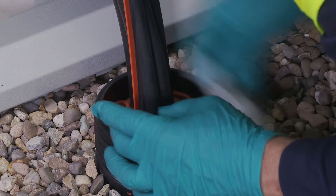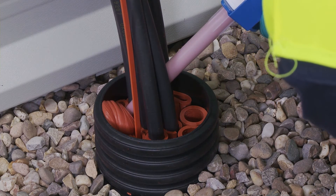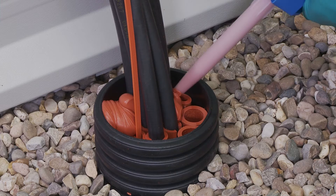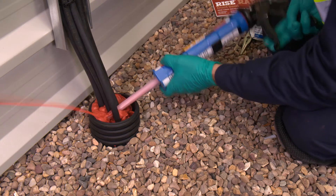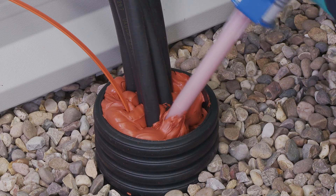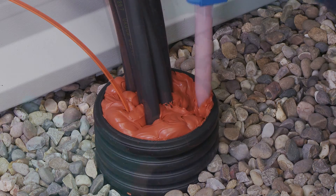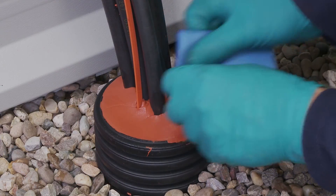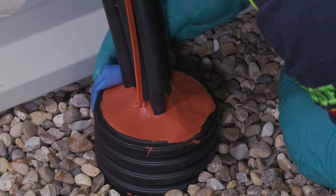After a final clean, apply the sealant in the usual way, paying particular attention to the separation between the cables. They should be moved around to make sure the sealant is adhered to each cable. Finish the sealant layer in the usual way. Use the cellulose sponge to pat down and then smooth the surface by hand.